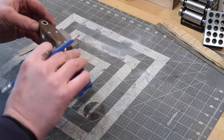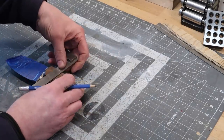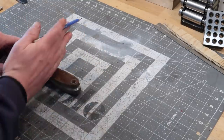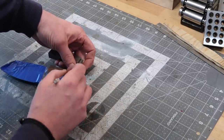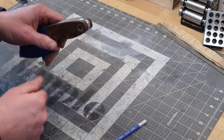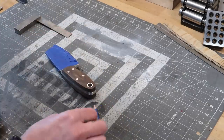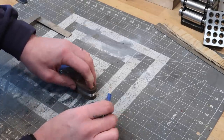That's pretty good. We can just do roughly the same lineup method on this side — using these pins as kind of my line that I'm gauging everything by. Keep this one roughly even, and boom — now I've got a pretty good little starting point where I can grind to. I'll taper this end in and make myself a mark. Same method: use a pencil down on something flat, shim it up how I need to, and put a mark like that.